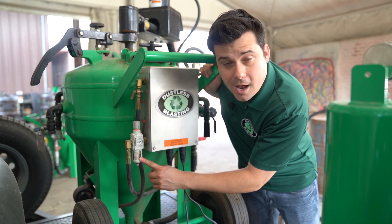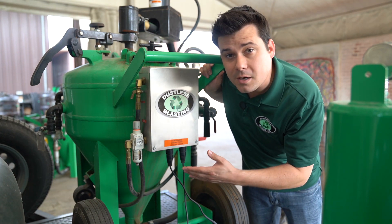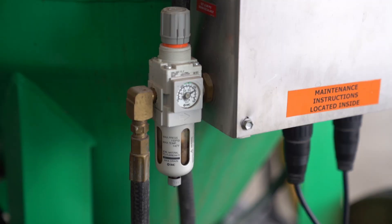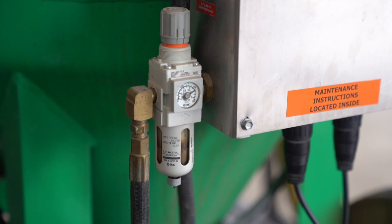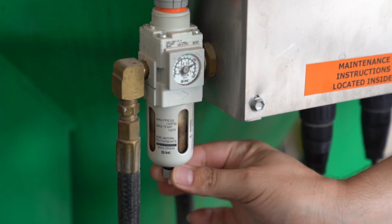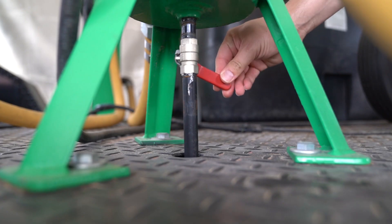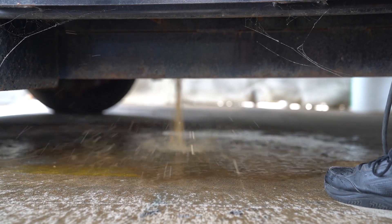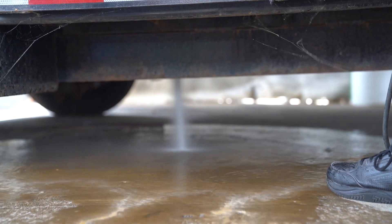This filter regulator's job is to limit the incoming air pressure and to filter out any debris before it can get into the control box. The filtered moisture and debris will collect at the bottom of this bowl, where it can be vented through this screw. Make sure to keep this screw cracked open to let moisture out continuously. And while you're at it, make sure you do the same thing to your moisture trap. Every now and then these may clog with debris, and you can simply open them up all the way for a second to clear the clogs.